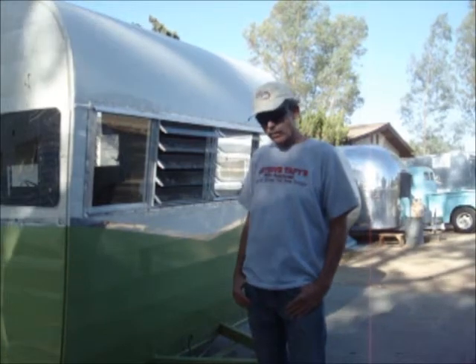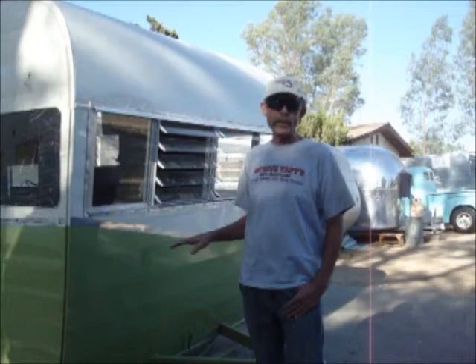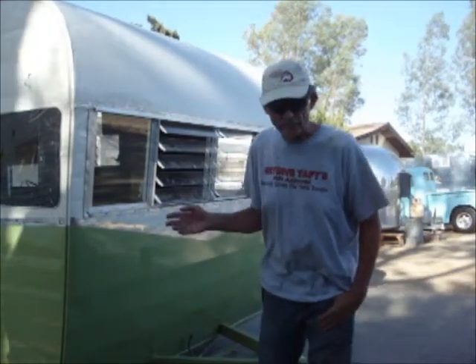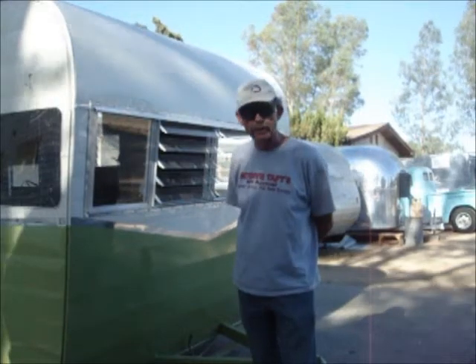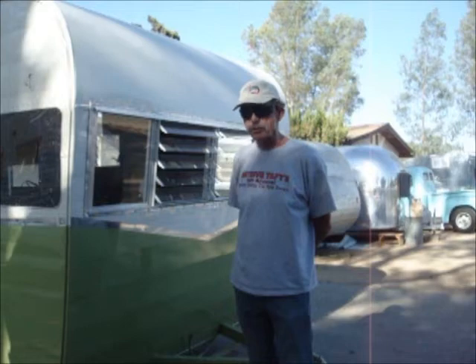You saw me do it in the DeVille and it came out pretty good. But one of the things I didn't know was that you're supposed to put the glue down first and let it dry, and then put the tile down. I put it down on the wet glue and for weeks we were cleaning up glue that was squeezing up through the cracks. I also didn't know how to cut it properly. So we're going to learn all these things now through Scott's efforts.